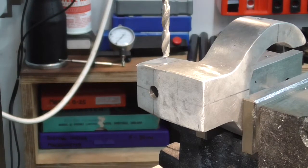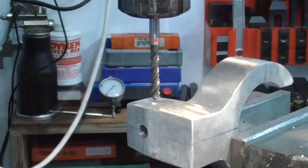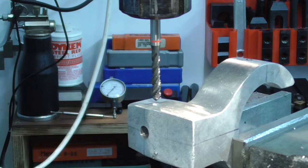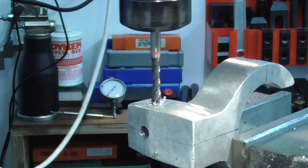All I should do for this one is drill straight through past the spindle hole, and I'll do the same for the tapping. Same again with the tapping, just under spindle size with speed control. I'm not sure whether it's going to thread through both sides — we'll see.